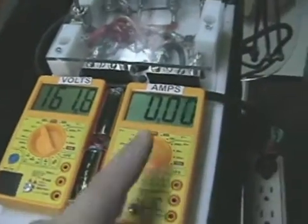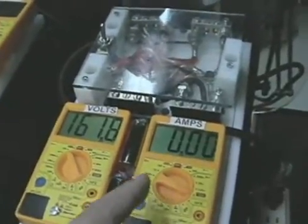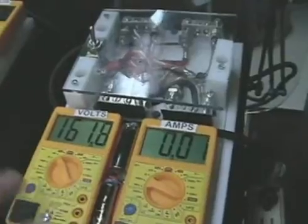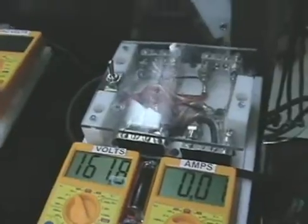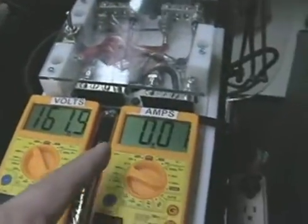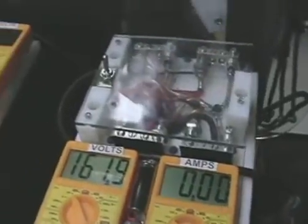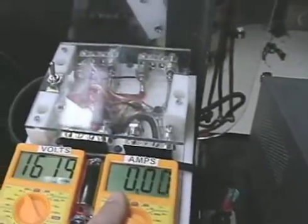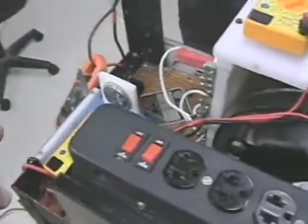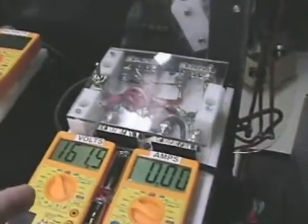The benefit of that is the amperage is now considerably lower. My draw amperage is about 2 or 3 amps at full speed — that'll go up when I start adding coils. But at 2 amps here I'm getting almost 20 amps on the battery. So 120 volts here at 2 or 3 amps, and about 20 amps at 12 volts into the battery bank. So go figure.